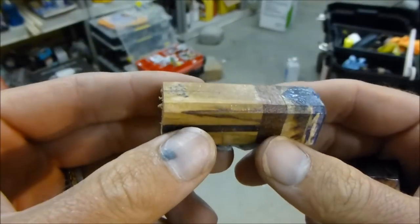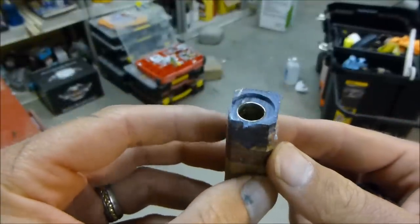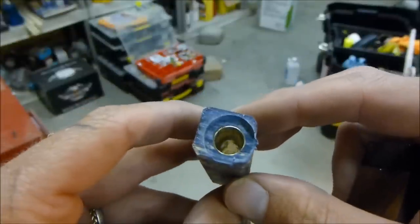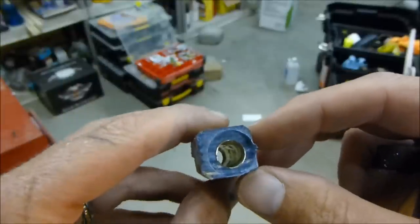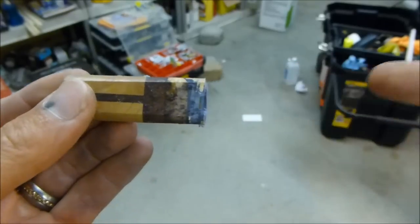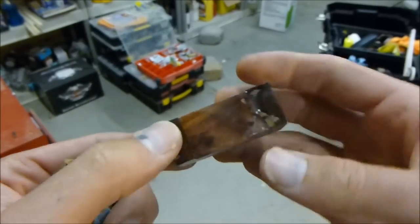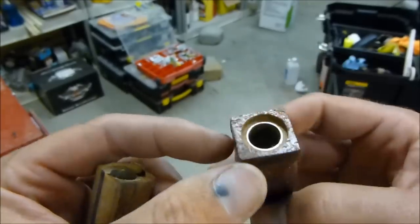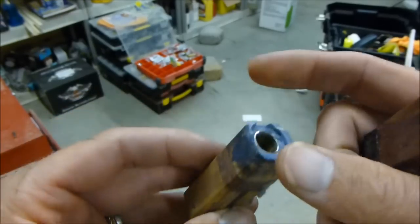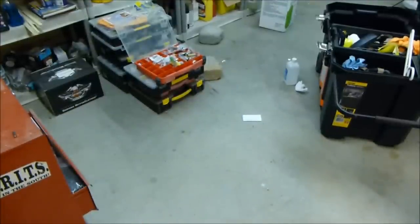Here's one piece — I've used a barrel trimming tool. It connects to your drill or drill press with a cutter on the end and a rod from the center to keep it 90 degrees. You just stick it in and it trims the barrel end. Both barrels are trimmed down and hopefully they'll hold together on the lathe. This is only the second laminate-style pen I've ever made.